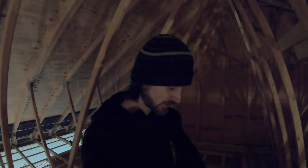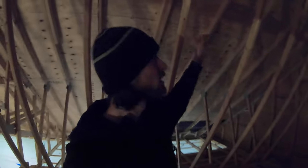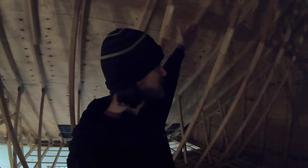I'm not a big firm believer in spray foaming closed cell. Definitely not to the top part of your decking. I know a lot of people will use closed cell on the underside of the decking, which is fine, but again, you have to worry about, are you spraying enough spray foam up underneath of your decking to achieve your local code's value? Closed cell for an R49 would be pretty thick, almost 8 inches of closed cell on the backside of your decking to achieve that.